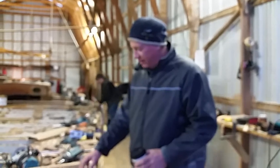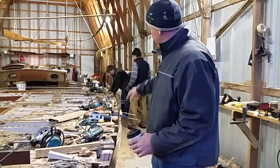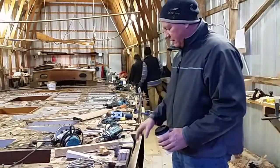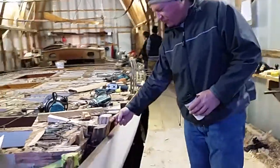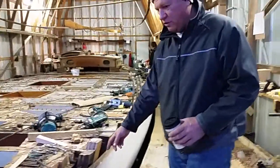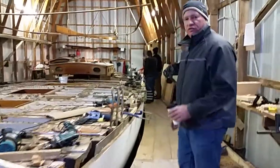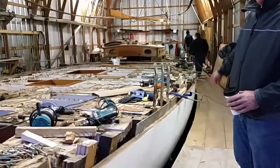These are the sister frames that Tony's adding here. We have six of them in place down there on the port side of the boat, and we have them ready to glue in on the other side. They're going to give us a nice clean face here for the planking to attach to. We're looking forward to screwing the new shear plank along this new wood.